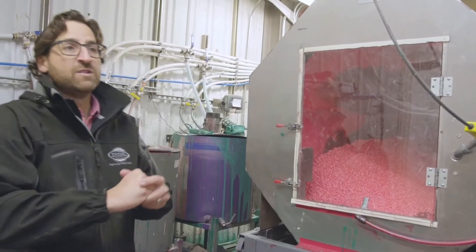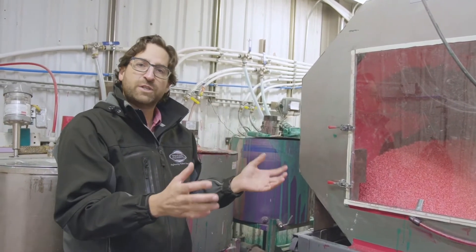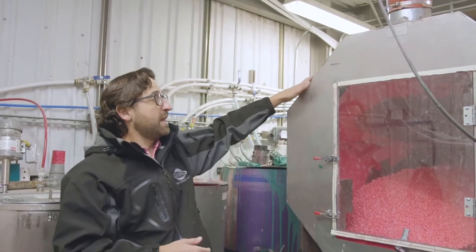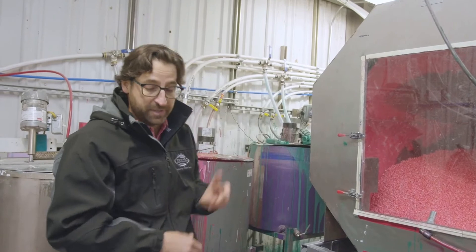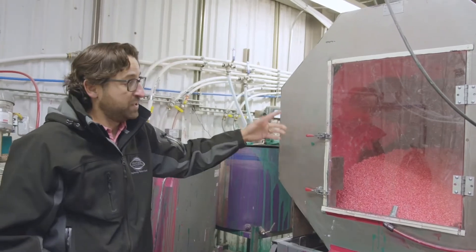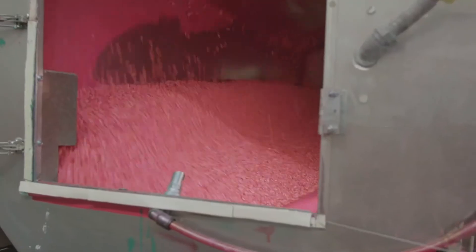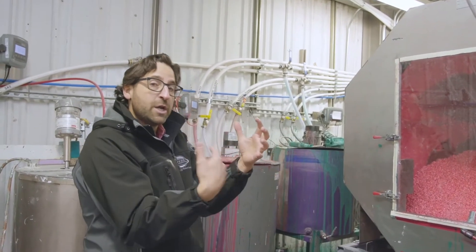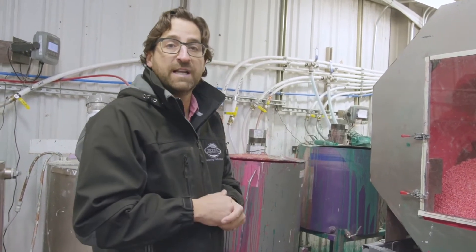Now we're in our treater room. We had seed in those bins waiting to go to the treater. We decide which grade sizes to treat, pull the corn out of the bins, send it up the leg to surge hoppers above us, and head to these treaters. We have two treaters in here. Our main treater is a continuous flow-through GLCPS treater, which constantly flows corn through and constantly applies the treatment. The other treater is a batch treater, which pulls a batch of corn, treats it, and then releases it.